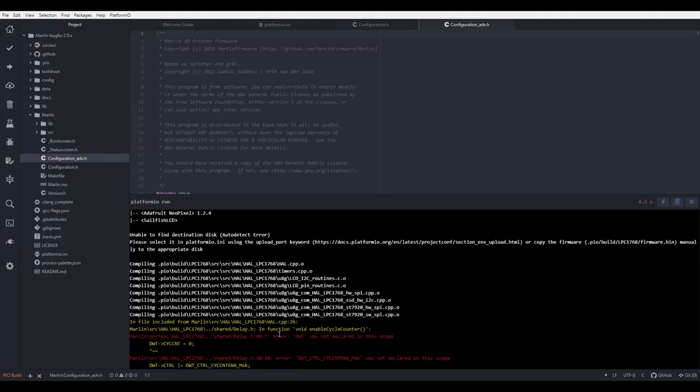And of course, since I'm recording this today for tomorrow, this video should be released tomorrow. There is a known issue with the latest version of the Marlin. As I said, no, maybe I didn't say, as the title calls it, it's a Marlin bugfix 2.0.x. So this firmware is not for production, meaning that there can be some bugs in it. Well, what I'll do, I'll load firmware that I'm currently using and I will compile that firmware.